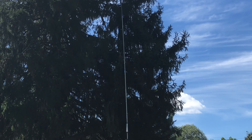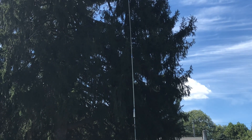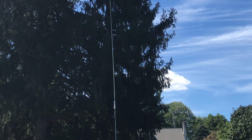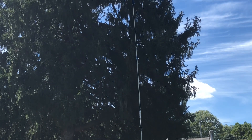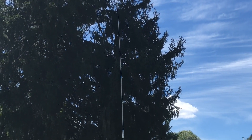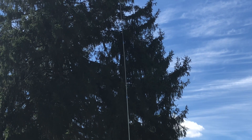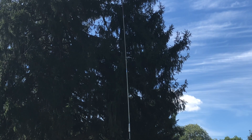There wasn't much skip going — I didn't hear anybody — but we'll keep trying. On 10 meter sideband, I'm just a Technician so I do 28.3 to 28.5. I'm really happy to have the IMAX experimentally hooked up to the Yaesu FT-991A. This antenna is 0.64 wavelength for 10 meter and I'm going to be giving it a go this weekend. I'll use it to listen to the other bands to see what I can hear.